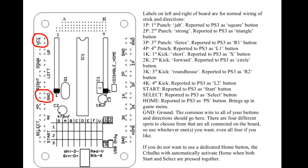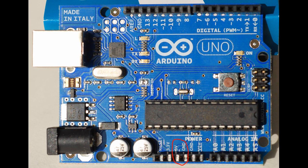Then you will want to hook up the UNO to power. You will find some on the existing Tootles Cthulhu PCB in your hitbox — use two of your cables for that. The two pins you want are marked VCC and GND in the schematic that Tootles provides. Hook up the VCC pin to the pin marked 5V on the UNO, and one of the GNDs to the pin marked GND on the UNO.